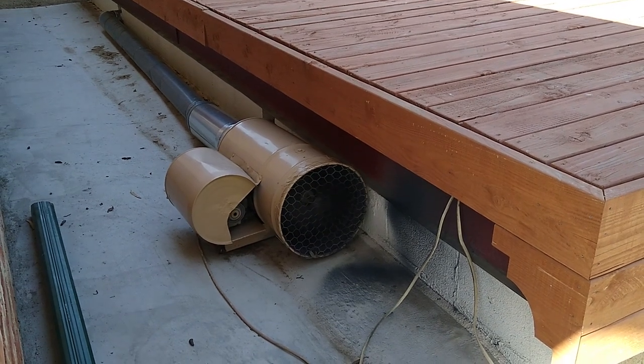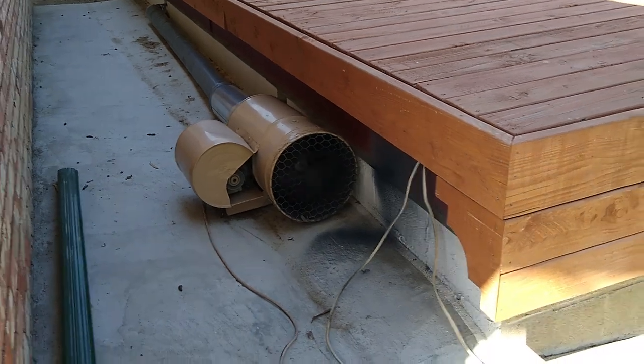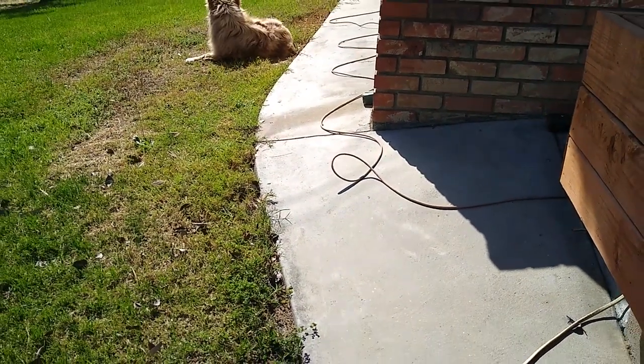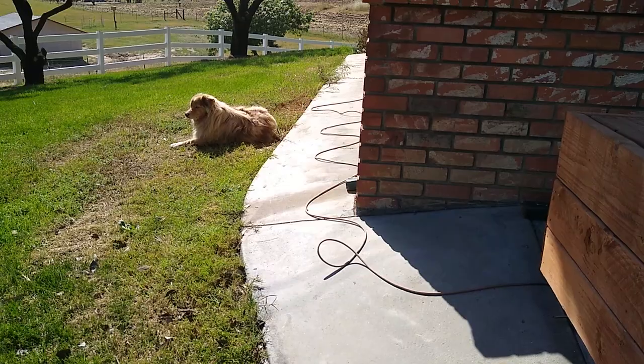Here it is in action — a little clearing out of the shop right now. That was the exhaust fan portion that I built myself many years ago. You guys could build something like it too. It's way more efficient than just a box fan, and it is kind of explosion-proof so it's a lot safer. If you're in your garage with a back door to your backyard, you could open that, put something in the opening, hook the exhaust fan onto that so it would draw fumes out of the garage or the shop. Then all you have to do is crack the door on the other side — and that's if it's cold weather.